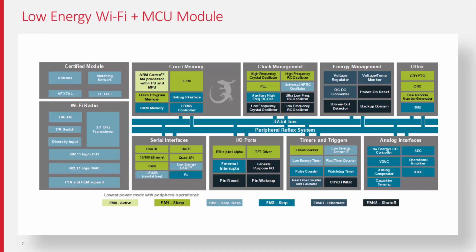However, with this part I think we offer some pretty good differentiation. The WGM-160 is really an entire application-on-module. The customer's application can use the LCD drivers, maybe they're going to use I2S microphones, it's got on-the-go USB, plenty of flash — this is a 2-meg device, 512K RAM. So the applications themselves can be pretty exhaustive. It's a very capable part, meaning really there won't be anything else needed in the customer's application for the most part. They could look at this as an entire solution in a single module.